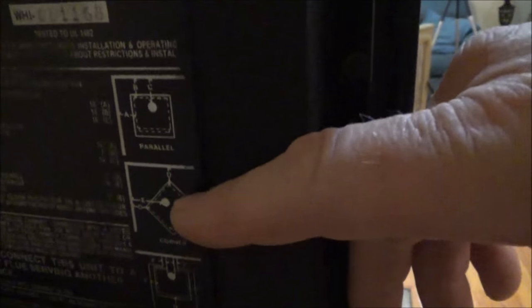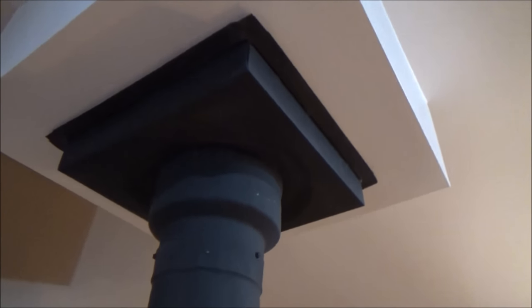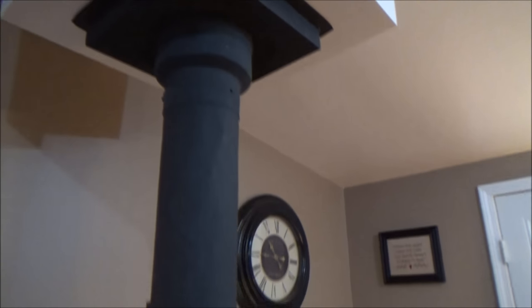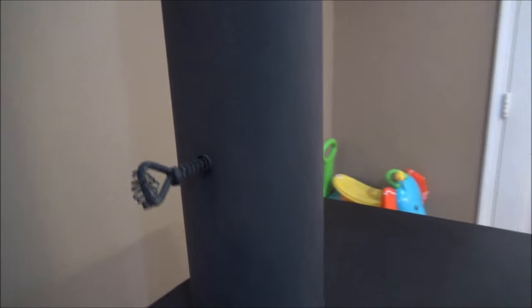After you get your stove, look on the back and there'll be a chart that tells you how far it needs to be from the wall. You definitely don't want to get it any closer than what it says. The same goes for your stack — when you buy the stack to go through the ceiling, it'll tell you the clearance to combustibles. Mine is two inches to combustibles going up through there, and I don't have any problem with it.